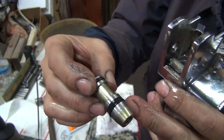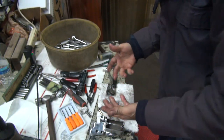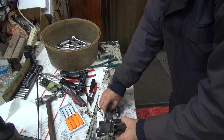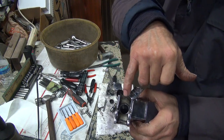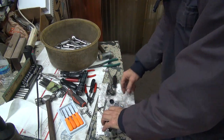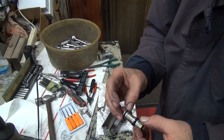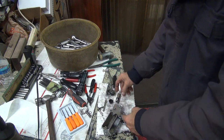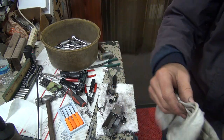The fluid just goes back and forth and doesn't do a damn thing. Can't bleed it, can't do anything. I should have checked that before — me being a dumbass, I'm trying to fix something that's already screwed up past repair. This bore is so hogged out right now it'll never work. Maybe new O-rings and seals might help a little, but I doubt it. This cylinder probably hasn't worked from day one, and that's why it was bone dry.